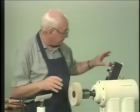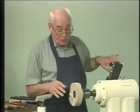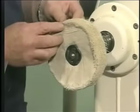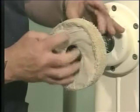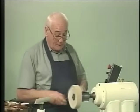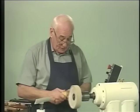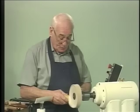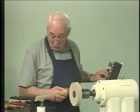onto the lathe. Just a point at this time, when you choose a mop, choose a loose leaf mop. It's very, very useful that we get a loose leaf. If you get the stitch mops, they're a little bit too hard. And we can start our lathe, and we can either have it open by being loose leaf and get into the mop like that, or we can take the speed up and have it as hard as we want. So it puts us in control.